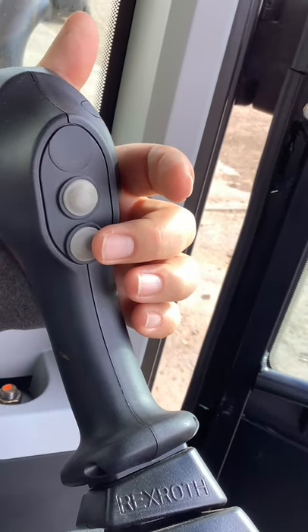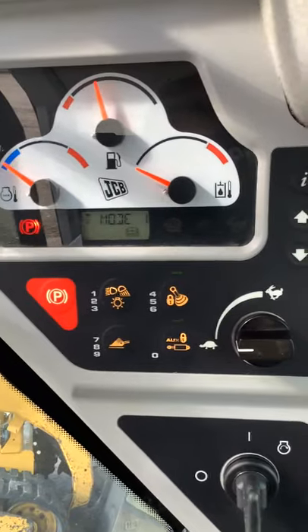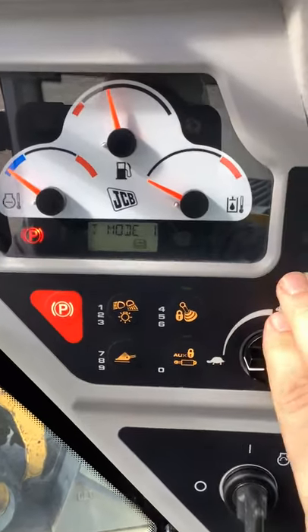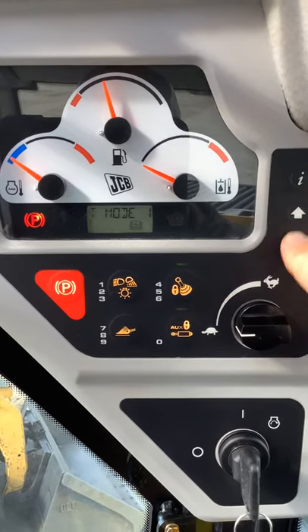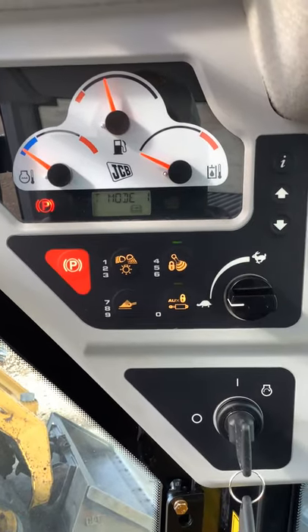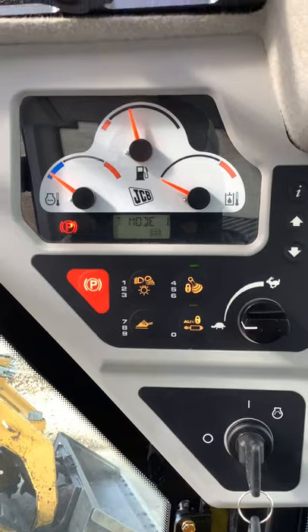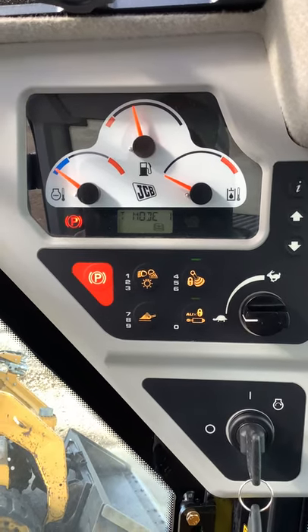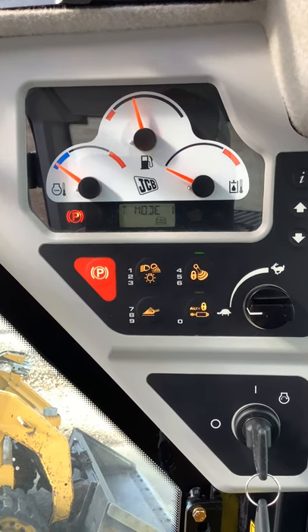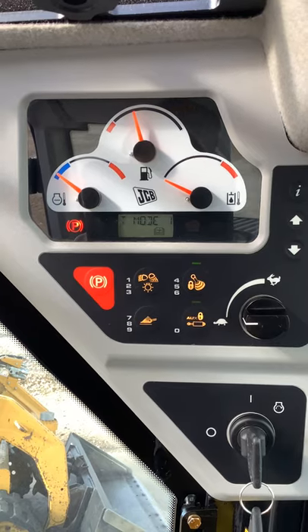This rear button on the underside is going to be your two speed and your creep. Up here on the dash, you can see you've got T mode one — if you hit up, it'll go T mode two, T mode three. T mode is going to be tracks or tires, and mode one, two, and three adjusts the sensitivity of your joysticks. On T mode one, your joystick is going to be the least responsive, the least jumpy. It's always a good mode to start out on, especially if you're not used to running skid steers or heavy machinery. You can work your way up to three, where the controls will be more sensitive and the machine will feel more jumpy.